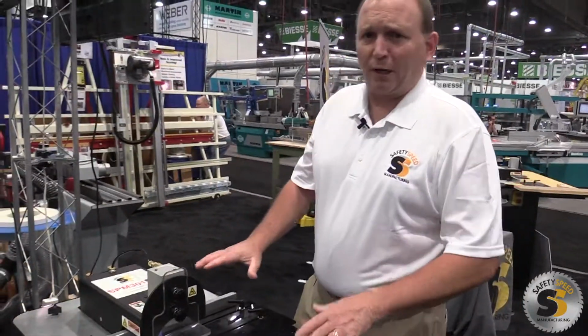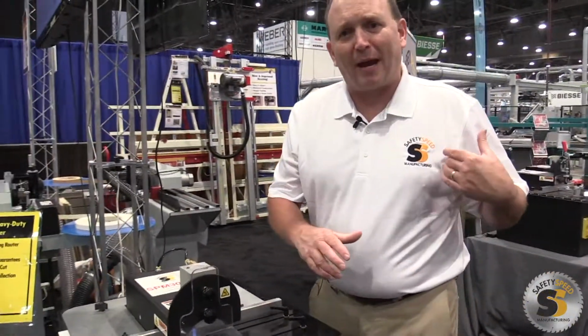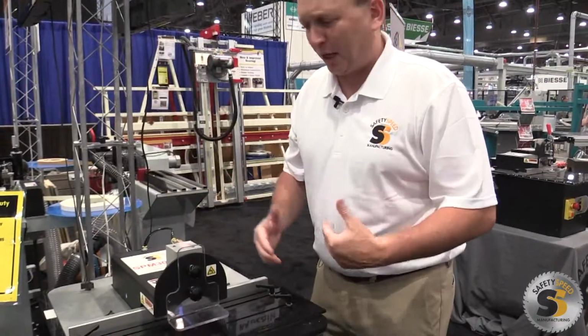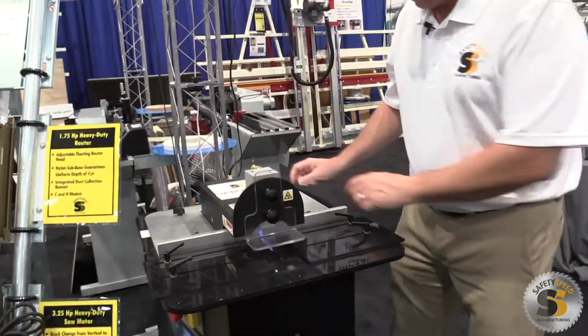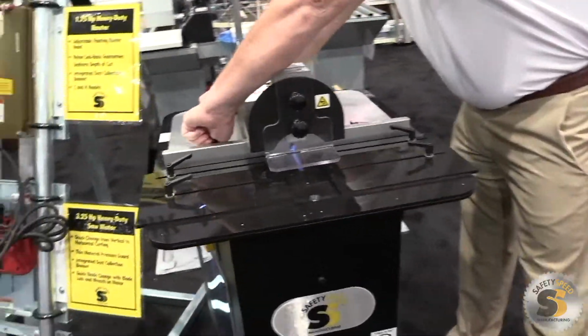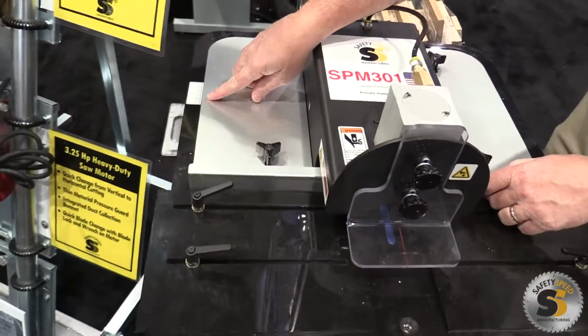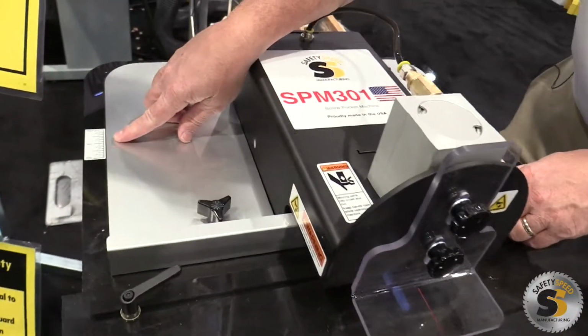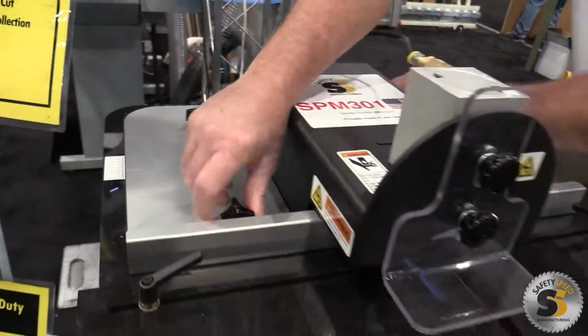This is our original screw pocket machine, and the key benefits that we've actually introduced into our manual machine and our high-end machine: the ability to adjust your web depth, so of different screw lengths, easily adjustable by just turning these knobs and adjusting your whole fence with an indicator here for easy adjustability for your web length itself or the length of screw you're going to be using. You can tighten this back in position.